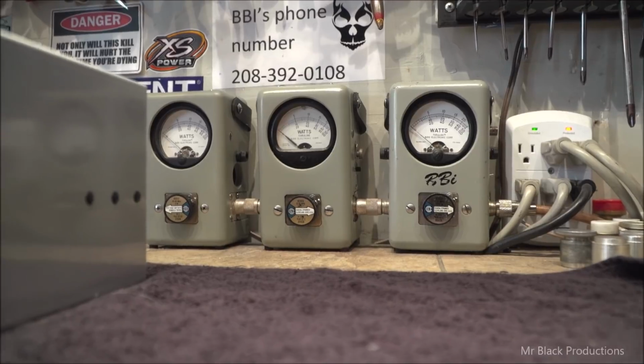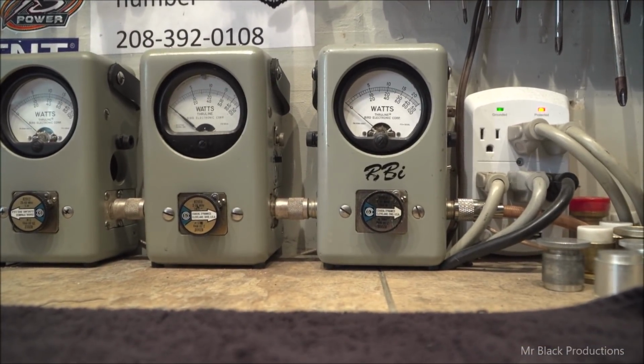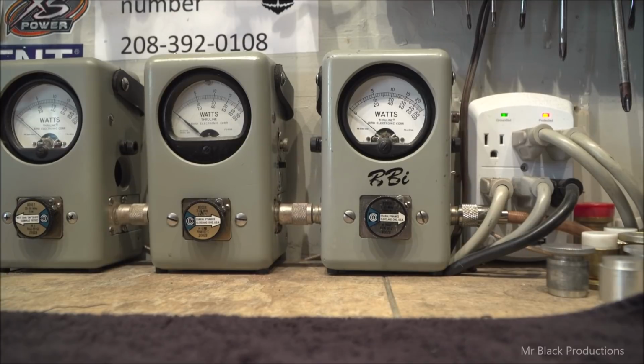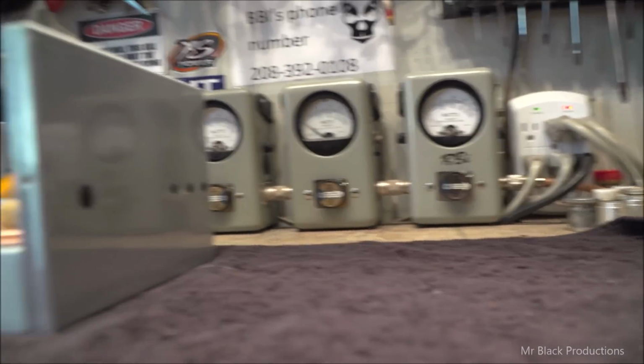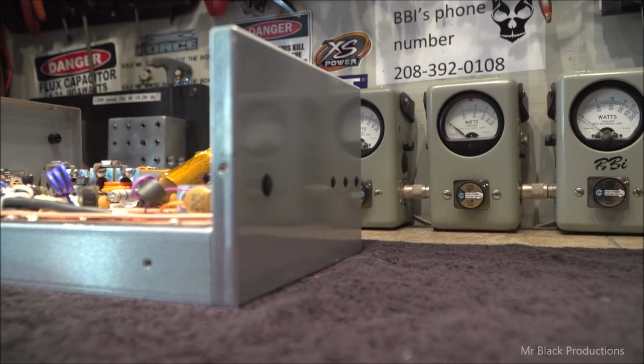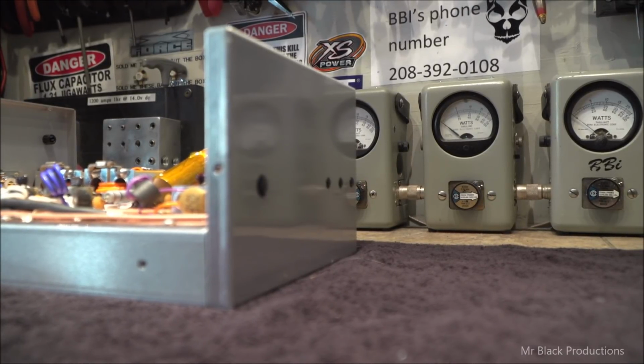Let's max this thing out, my power supply. What are we seeing, 15 some change with 20 watts of drive? Hello. 1650 out of a 2x4. Remember, this is only good for 20-30 seconds. This is not the way you'd set a box up to talk on it every day. We'd end up having massive failures and all kinds of other issues. So 20-second key down driver versus an everyday box, there's great differences.